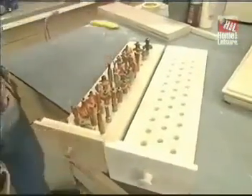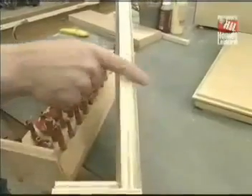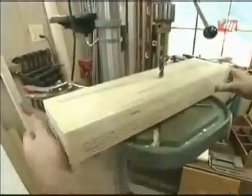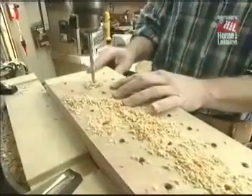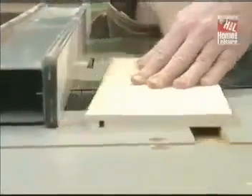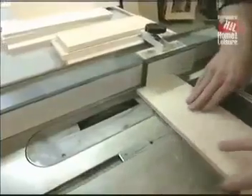The original bit storage drawer worked just fine, so we repeated the design. Same layout: a piece of three-quarter-inch plywood with through holes and a backer of quarter-inch plywood. I want four drawers set up for half-inch bits, so I've ganged four pieces of plywood together and will drill all the holes at the drill press. These are a couple of shelves for the quarter-inch shank bits. All the drawers need a quarter-inch bottom, and all the sides need a quarter-inch groove to receive it — I've set up the dado to do that.